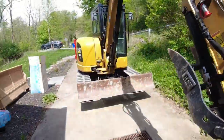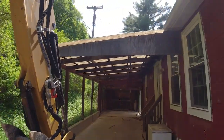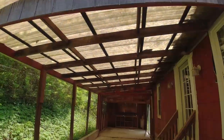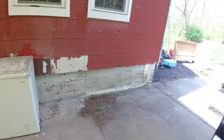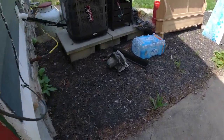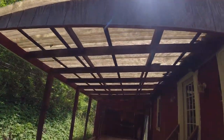This dumpster that I rented from Junk Kings is 11 feet long. However, I'm gonna double check that measurement, but I believe those sheets of fiberglass are 12 feet. So provided that is the actual measurement, I'm gonna take my awesome power saw. Where'd it go? Right there. I'm gonna set the blade down so it just hits that bottom ridge, and I'm gonna cut all of these right in half.